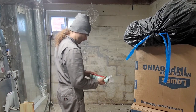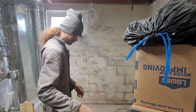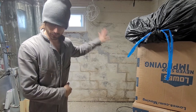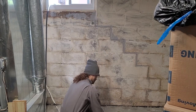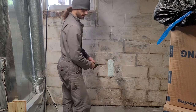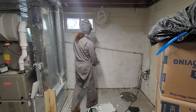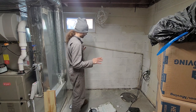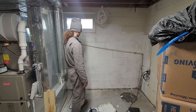All right, now it's painting time. I'm going to use a three-quarter-inch nap paint roller — three-quarter-inch nap for rough surfaces. Actually, before I do that, let me clean first. All right, now we've painted. Hopefully we have enough. With the exception of it looking a little sparse — I did run out of this Drylok paint — it's looking a lot better. Got rid of all that old mold and water staining and all of that bad juju, and now it's looking fresh.